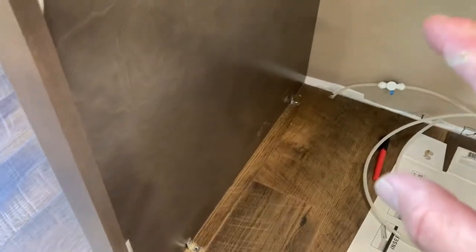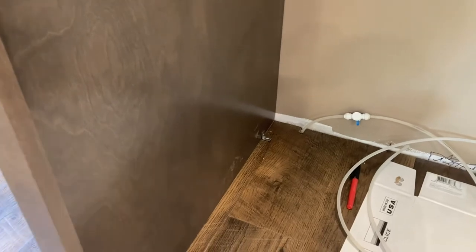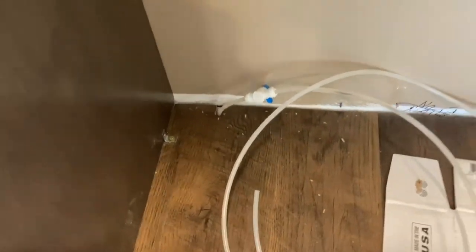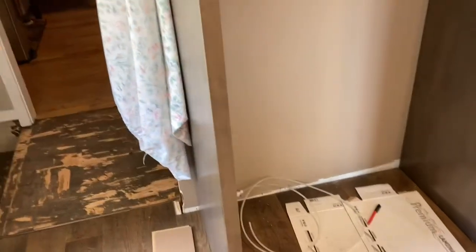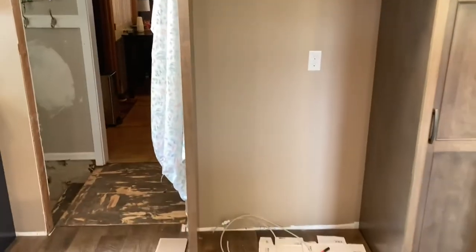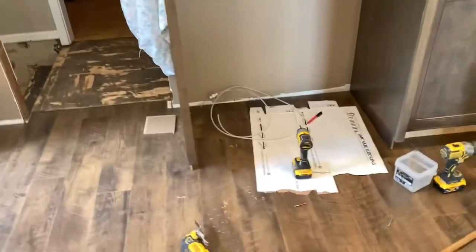Another thing — you also want to make sure you get it lined back up where it needs to go. I did mark a line back here. So I'm going to put the foam down, screw this in, and then show you when I'm done. Regardless, I know the screws don't match, but the refrigerator is going to sit in there and cover up that whole front. The reason for screwing that down — I've seen so many of these where they've taken finish nails and tried to put a finish nail through. That's a stupid idea. This is going to be in a walkway and at some point somebody is going to graze that, and you just want to keep it from moving and breaking. So anyways, little tip for the day. Hope it helps.